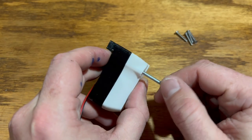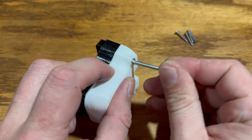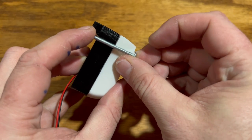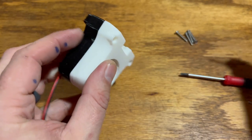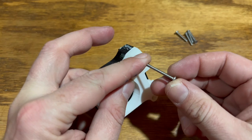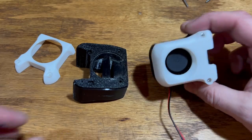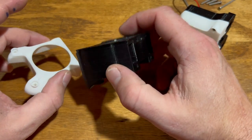However, the screw head on the number six is a bit bigger and it doesn't countersink in there, and it's obviously a bit heavier and sticks out the back a bit more. You can get away with going down to the one-inch versus the one-and-a-half-inch on the number four screw because of the countersink. That is why I opted to modify the file and use a one-inch number four screw. So I'm going to put a one-inch number four screw in on each side. The cooling end is almost done, but next we need to move on to the hot end assembly — and that's where we run into option number two.